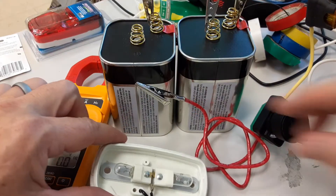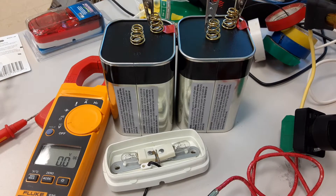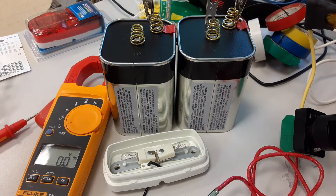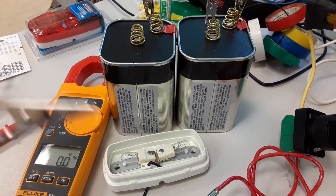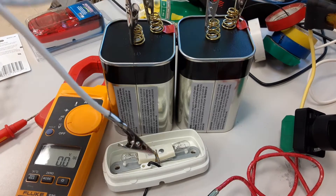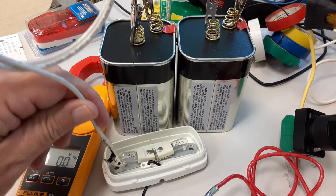Here's my positive connection going on this wire. For the negative connection I made up a jumper wire - I used white only because that's what I had. I didn't want to use green because green is a ground conductor, white is a neutral conductor. For DC circuits it's common to use blue for positive or red, and in vehicles black is your common color for the ground side. We just shouldn't use green.